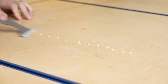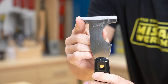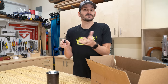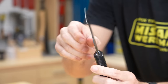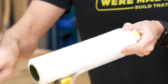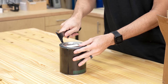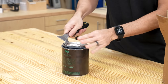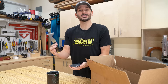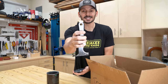I use this on dry glue whether it's on a glue-up or on a table. It's got a nice little hook at the end which is great for breaking a caulk joint if you're removing trim. This little hook here is for scraping excess paint off a paint roller and it works really nicely. And this end piece is great for opening cans of finish — you can just open it right up and you don't need a little can opener. Those are the traditional five-in-one uses, but this is actually a six-in-one because it also has a little hammer end.